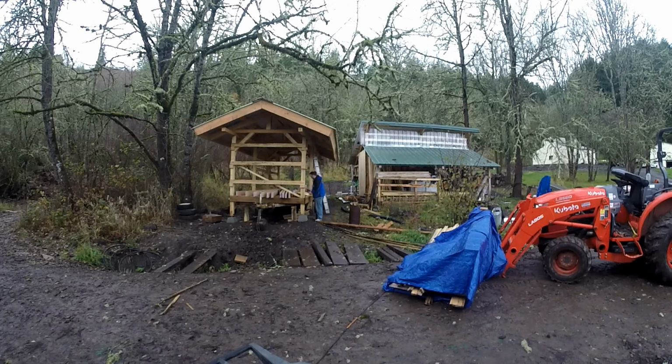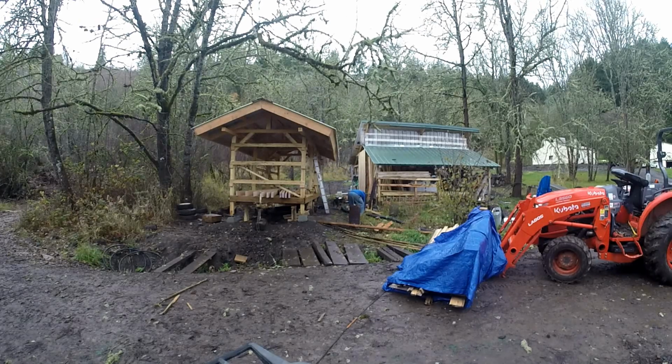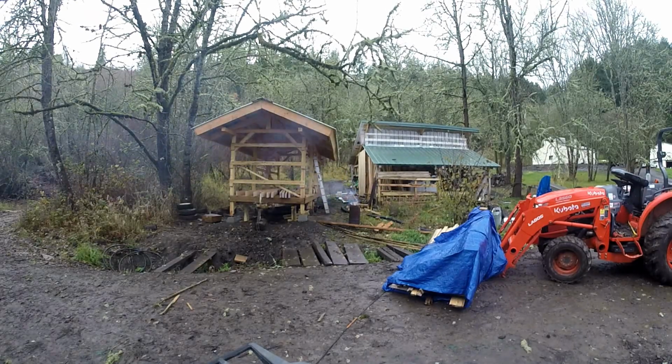But the main focus of today was to just get rid of some of the more usable scrap, I guess, and take advantage of the fact that I had a bunch of boards, and keep working on making some pallets for the lumber. The primary function of the pallets is obviously to move the lumber, but one of the secondary benefits of having it on one of the pallets is that it actually allows airflow under the boards so they dry a little easier and better, and also to keep the lumber from touching the metal of the forklift, or of the pallet forks.